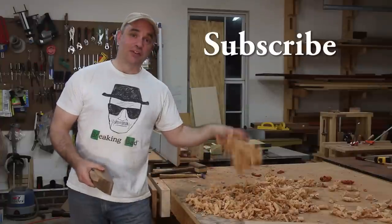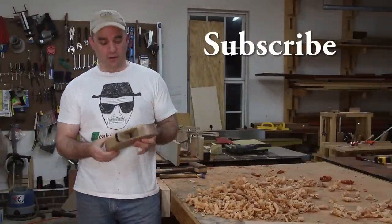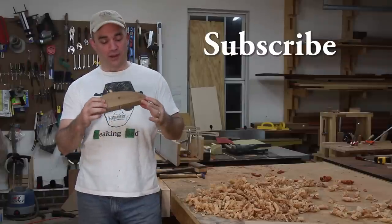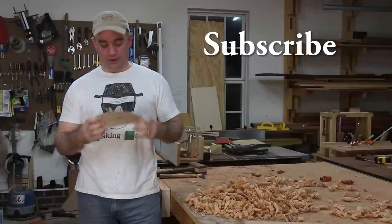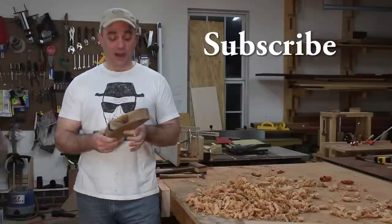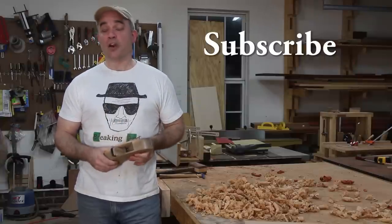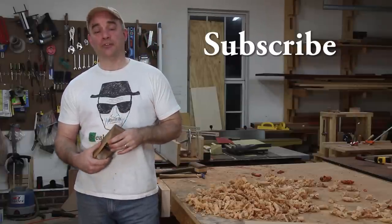As evidenced by these shavings, I've definitely been having some fun with my new hand plane. I hope you guys enjoyed watching this video. Is it perfect? No — I put the blade on the wrong side of the hand plane. It was supposed to go on the 45 degree side instead of the 62 degree side. Oops! Still works surprisingly well, and I will definitely be making another one — next time I'll put it on the 45 degree side. If you're not already subscribed to my channel, I hope you'll consider subscribing, and I'll see you guys next time.